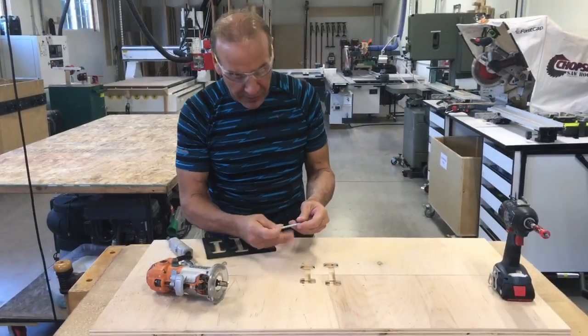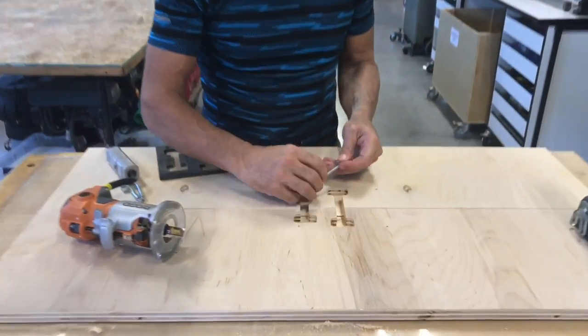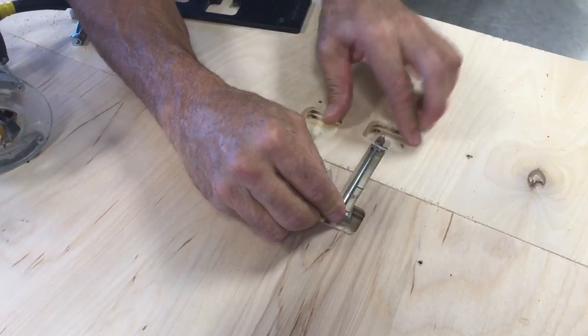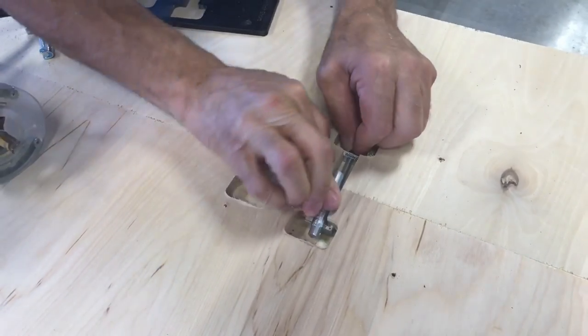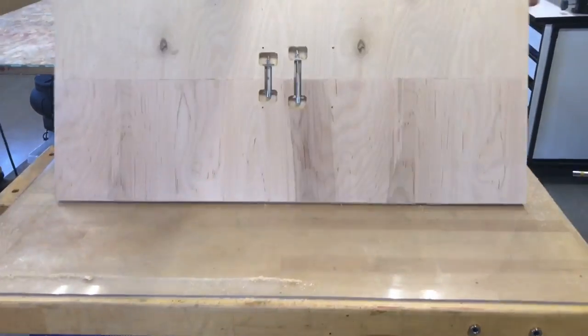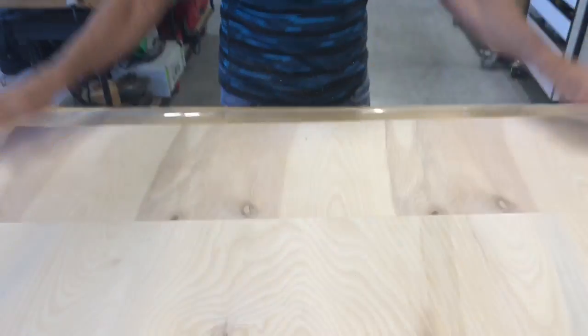And of course, the screws go right on the magnet that goes on top of your screw gun. And then you just put the FlipBolts in. Very easy. Just tighten them up just like you would a dog bone with your fingers. But instead of using a wrench, just flip it over and you're done. Tops joined together just like that.